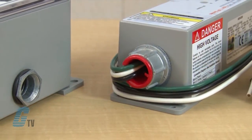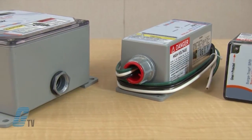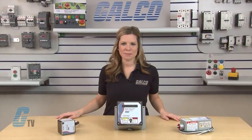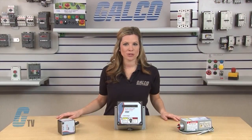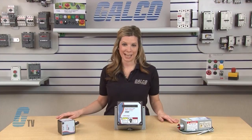The X-Line is UL-1449 3rd edition approved surge protection devices housed in a NEMA 4X polycarbonate enclosure. These SPDs have a true no-fuse surge design. They do not require additional fuse components or overcurrent protection.